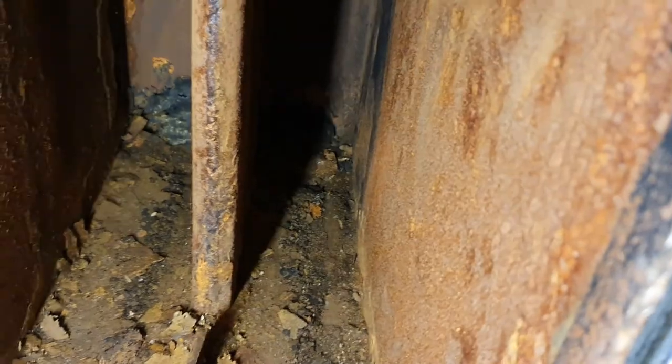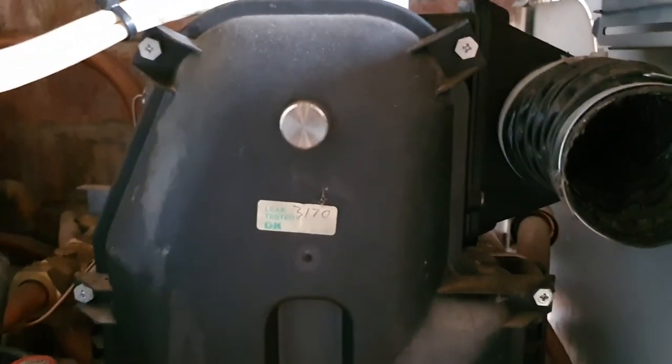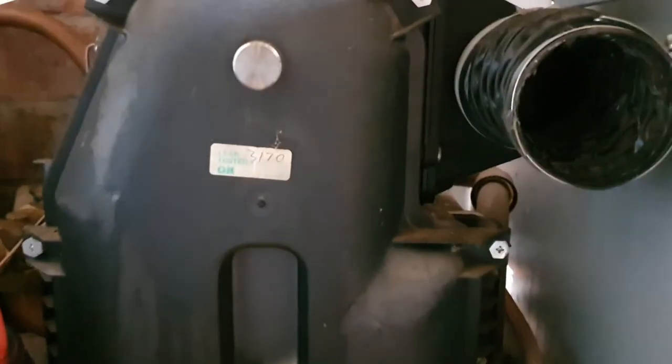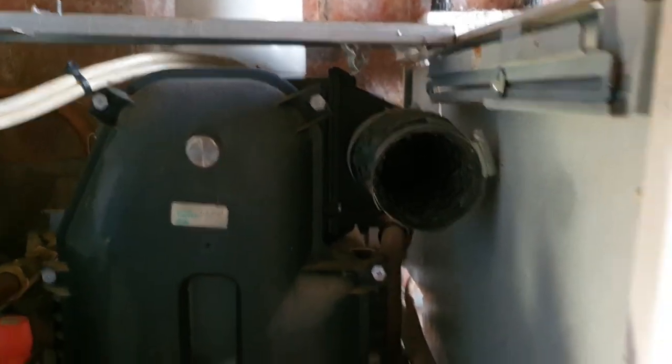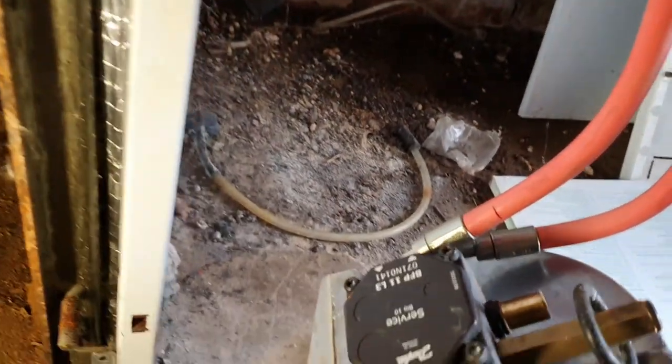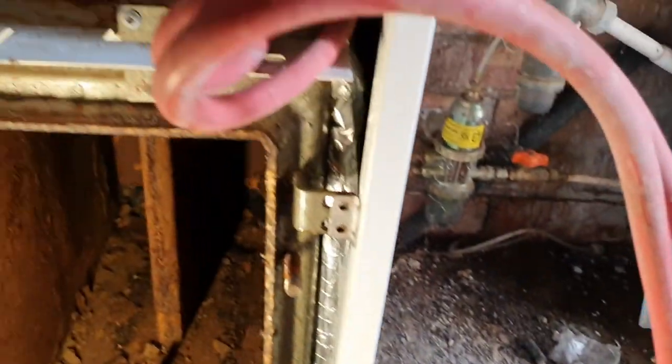This needs a good clean out now - I've got a little Makita vac I use for these. The secondary heat exchangers are easy to clean as well on these, but don't ever use wire brushes on the secondary heat exchangers. I normally just wipe them off with a damp rag because they're coated in a special coating to stop the stuff sticking. You can scrape the main exchanger out with a wire brush, but be careful - don't use wire brushes on the secondary heat exchanger because you can damage them. Then it's just a strip-down of the burner, change the hoses and set it all back up.